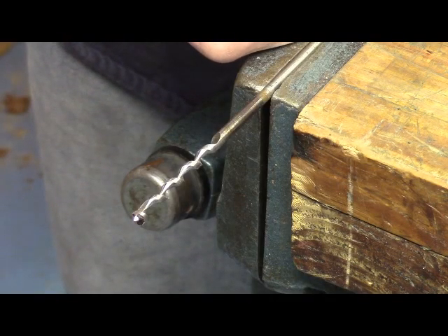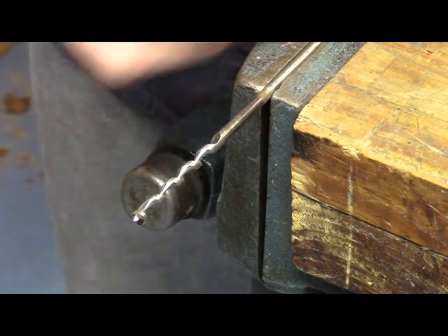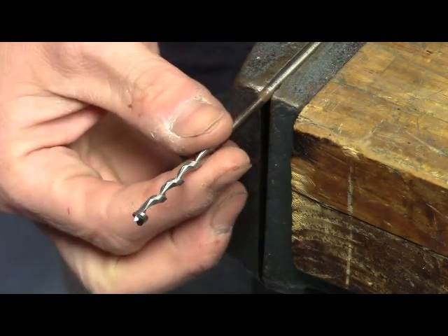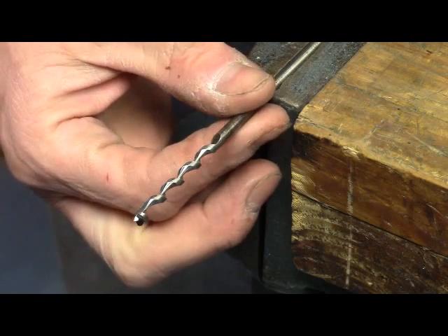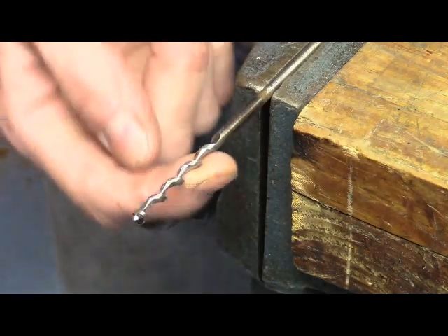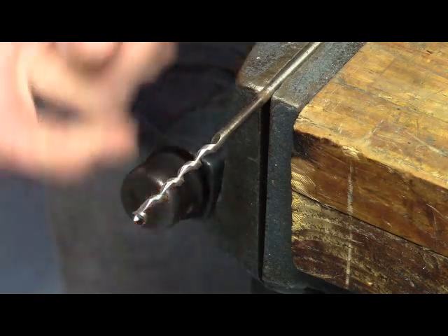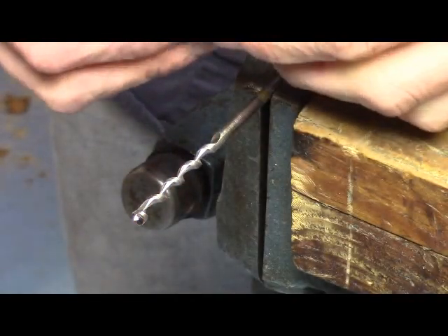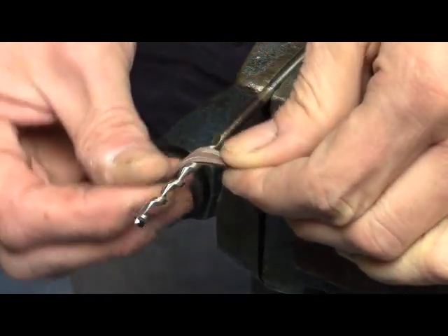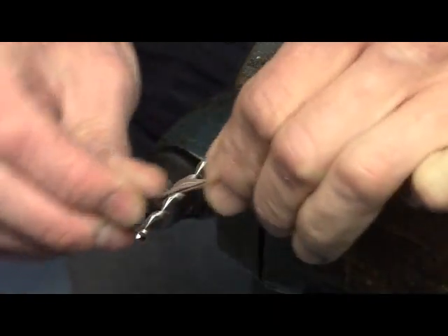At the heart of the attachment is the drill bit and the mortising chisel, and both can benefit from a little attention. As it came from the factory, the quarter inch drill was pretty well formed, but some of the larger ones had quite a few mill marks on them. So I took a fine half round file and cleaned up the flutes on the auger. Then taking some 320 grit sandpaper, I folded it creatively and worked those flutes in a shoeshine fashion to get them polished up.